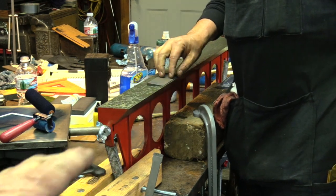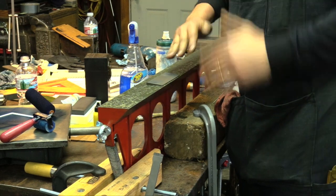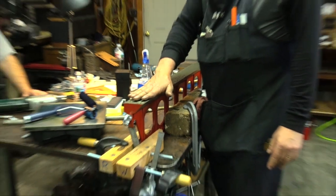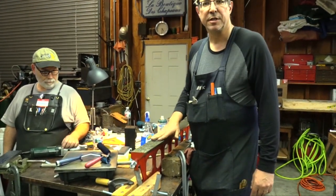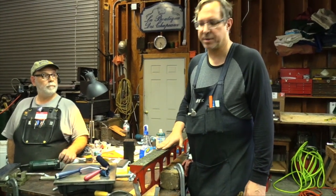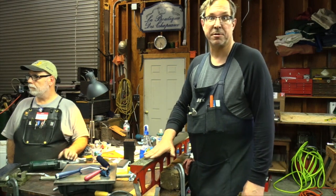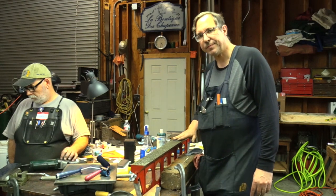Both on the dovetails, the angle. Yeah, dovetail I haven't really gone for points yet. I got it flat, but it's rough, so it's probably 5, 10 points per inch. Up here I probably got 15-ish across the whole thing though. And so now I'm just trying to bring in more and more points. And right now I just finished the pass, so I'm just stoning off the burrs and then give it another go. Go back to the blue and see where you're at.